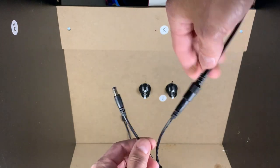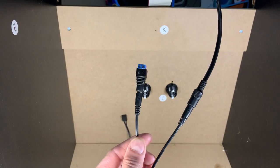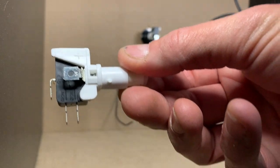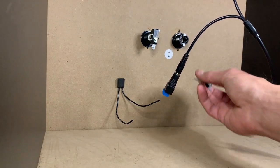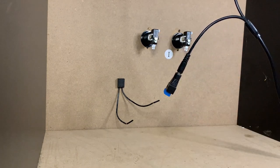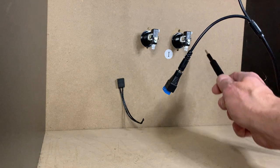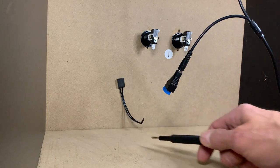What's remaining is going to be used to power our switches. We're going to use an adapter with two terminals that'll allow us to break this out into plus and minus. Here's the actual switch itself — you can see the positive and negative. They fit into the buttons installed on the front of the cab, going in at an angle and then twisting to lock. We're going to take our negative leads on the left side of the switch and daisy chain those together, take them back to the connector, then take the positive leads, break that through the switch, and take that back.